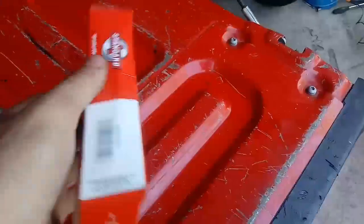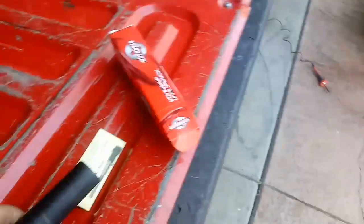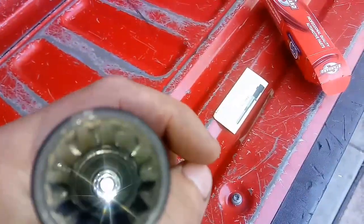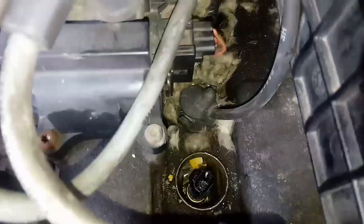It's about 37 bucks. You're going to carefully get the socket over the plastic piece on that new one. I'm using a 12-point socket just to reduce the chance of breaking the plastic piece. You're going to put it in there and barely snug it, because I made the mistake of breaking the first one.